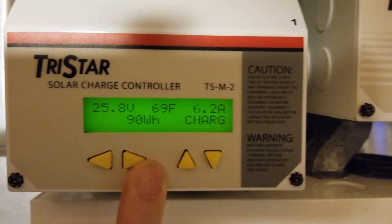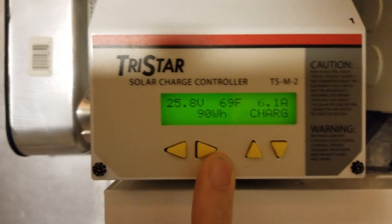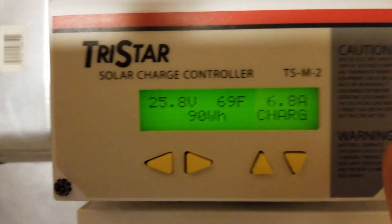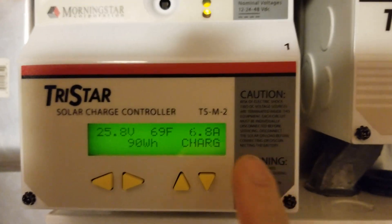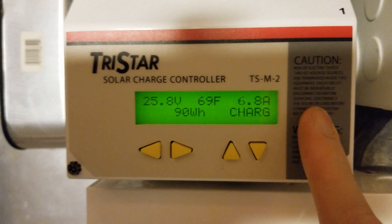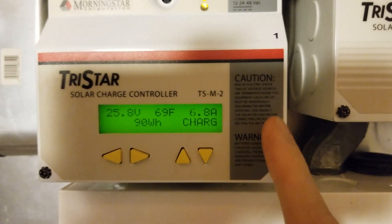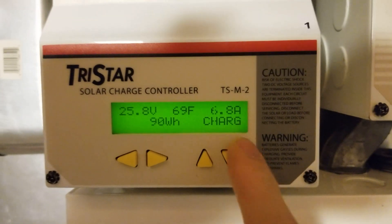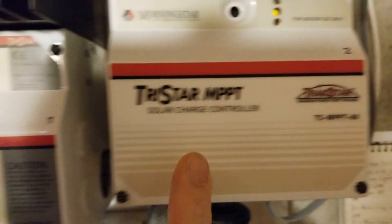That's how these work with the meter hub hooked up — it allows the two controllers to communicate, and that's what you see on your displays. This is the exact same thing I see upstairs. How you set up the meter number on these displays is you can do it directly on the meters themselves on the charge controllers. You don't have to go through Ethernet and the MS View software. This meter I've designated as meter number one, and this one as meter number two.